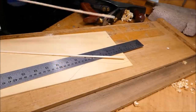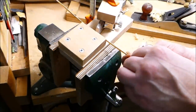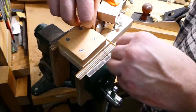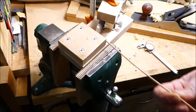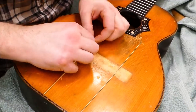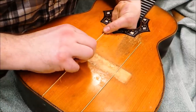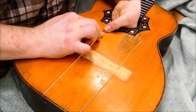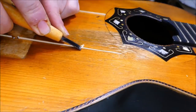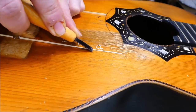I refine the thickness using my veneer-sizing setup, which is an old Stanley bullnose rabbet plane on its side used as a scraper. I advance the blade by only a tiny fraction every time because spruce in these dimensions is pretty fragile stuff. To glue in the splines I use hot hide glue — I get some in the crack and work fast, because not only does the glue set quickly but the moisture it introduces starts to swell the wood almost instantly. If you wait too long, what was a perfect fit becomes too tight to get the spline in. When that's had a chance to dry I can pare the excess away. I'm using the chisel in a bevel-down attitude so when I get close to the top I can steer with the bevel and not dig into the finish.